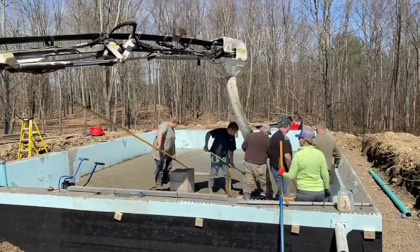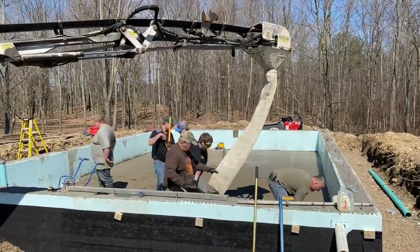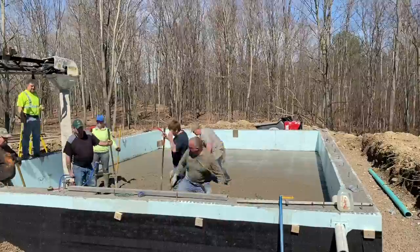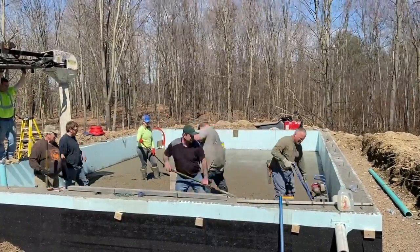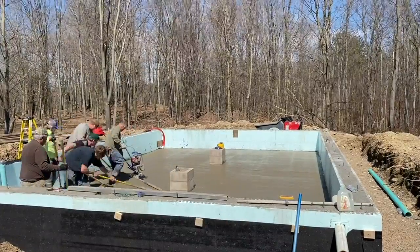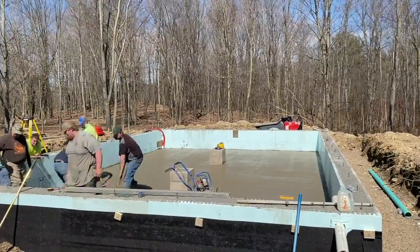It was a nice day, a little bit windy, but the sun wasn't really cranking on our heads. And we poured about probably a 5.5 slump on this concrete. Like I said, I wanted to get used to it a little bit, but it finished up good at the end. It had a lot of cream in the concrete, so it closed up nice. The stones are round in this concrete versus the other company I use is more of an angular stone, and they're smaller stones, so that took a little getting used to.